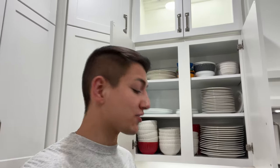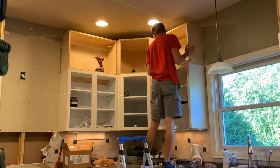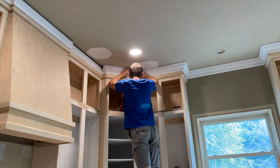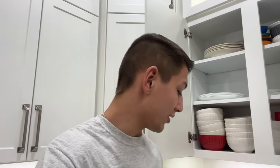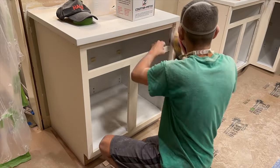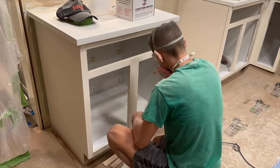After your cabinet boxes are all clean, the next step is to start sanding. This is also the perfect time to make any modifications to your cabinetry — I decided to take my cabinets to the ceiling by adding a small cabinet on top and then adding crown molding. I'll make a separate video on that later. For sanding, use 120 to 180 grit sandpaper with an orbital sander, lightly going over all the cabinet boxes and surfaces that will be painted. You want it to look cloudy and dull — that's when you know you've sanded enough.